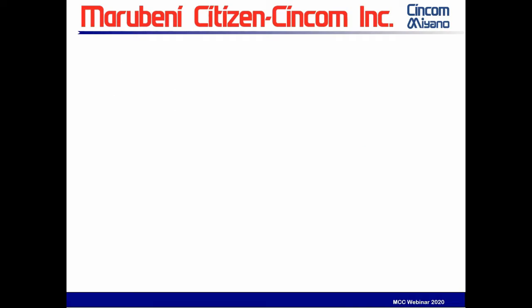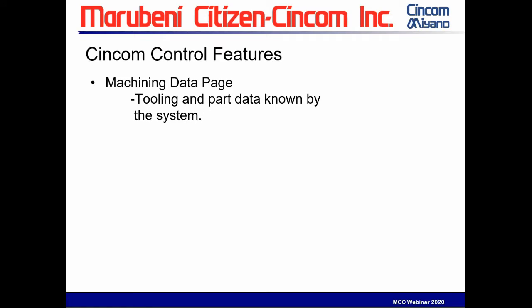And some of the things we can do with this is the Cincom features. Machining data page, this is central to how you program our machines. On this data page, you input data such as the material diameter, you call up the cutoff tool, the part length, all the key features of the program are set in there. And from that, we get a lot of automatic functions that we can utilize.